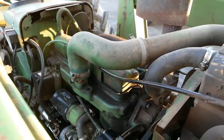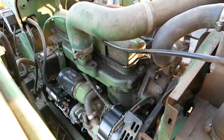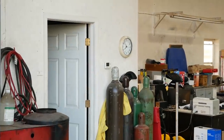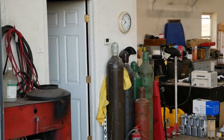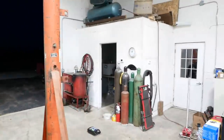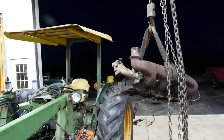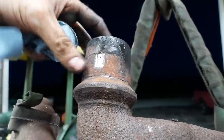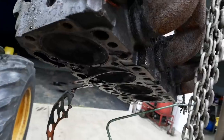I don't see any choice — I'm going to pull the head off and just take a look. Four-cylinder engine, I don't think it's too bad of a job. It is currently about five minutes to eight o'clock p.m. and I'm hoping to have that head off by nine. I'll bring you back when it's done. It would have been done sooner if it wasn't for a stupid exhaust flange. The head gasket came off in multiple pieces, so it's going to be hard to tell what really happened.